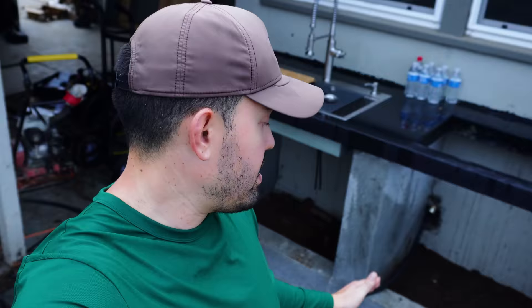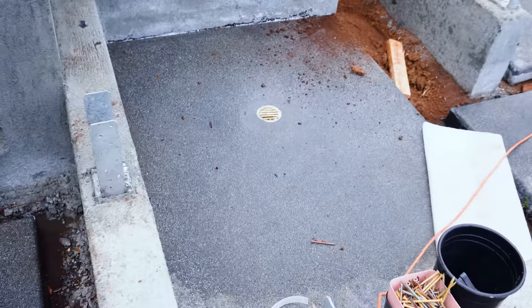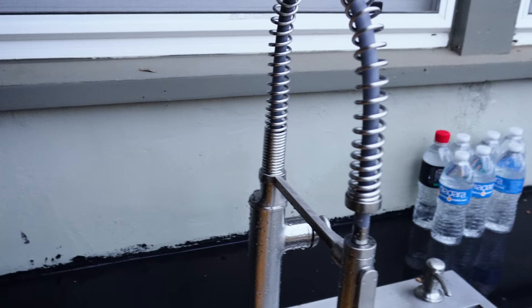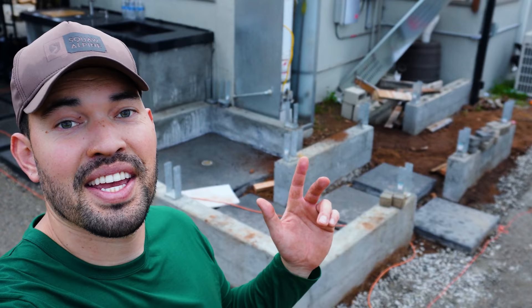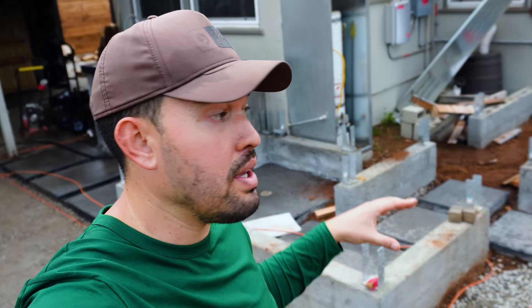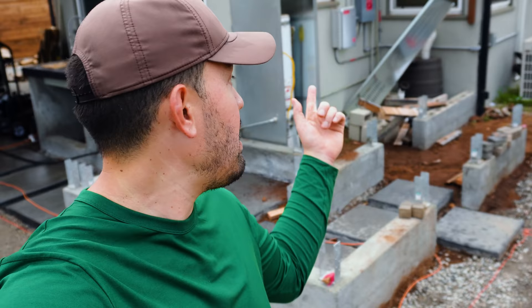They applied the acid etch to the steps. Take a look — it shows off the grain in the concrete with a nice dark color. We also did it to every part of the shower steps, and we're looking at a structurally complete shower. I threw in this incredible sink faucet and the sink is in, though the plumbing is still not connected. The last piece of stonework is the final coat of stucco on both the shower walls and the sink. After that it's the woodwork, the stone pebbles going in between, how we'll plant between all the paver bases, building out the sink cabinets, and replacing the water heater so we can plumb up the shower and take a hot shower out here.